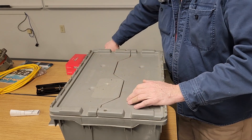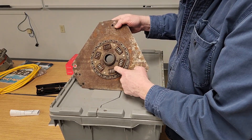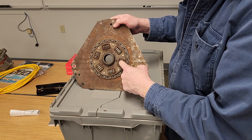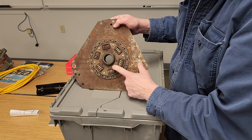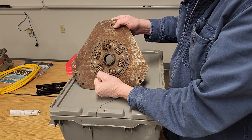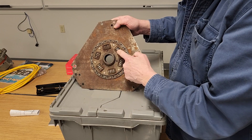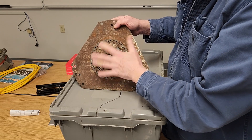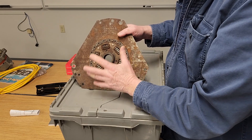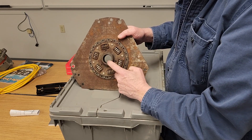In an inboard application, it's similar. We typically use a drive coupler bolted to the flywheel of the engine, and then this is where the transmission shaft goes into. This plate is riveted through another plate, and there are springs that separate the two plates — so it's suspended. Over time, when you shift, the springs wear and get play, and at idle in an inboard engine it makes a chatter noise at dead idle in neutral. When you shift it into gear, the noise goes away. So if you have an inboard engine with a clicking sound in the back at neutral idle that goes away as soon as you put it in gear, it's probably a bad drive plate.